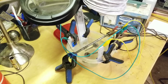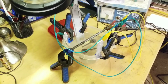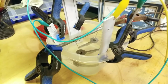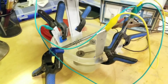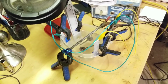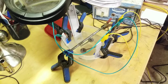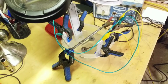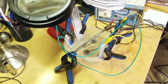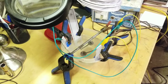Not too bad. Controlling temperature is a really important part of the anodizing process. Like I said before, this bath should be between 0 and 10 degrees Celsius, ideally. And the dye bath should be about 60 degrees Celsius. Once we're done anodizing, we're actually going to boil this in distilled water for about 20 minutes to seal the pores. And that's going to finish off the anodizing, give it that nice hard coating, and make sure that the pore structure can't actually absorb anything from the environment.